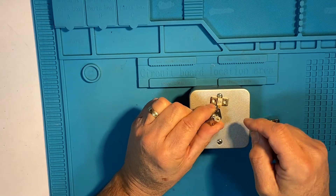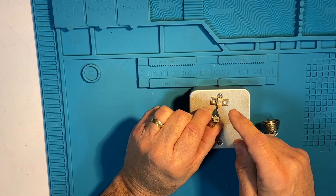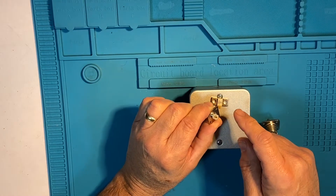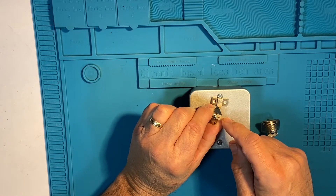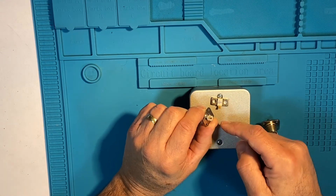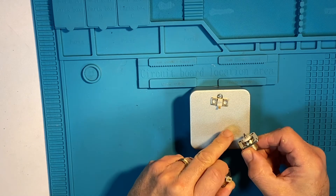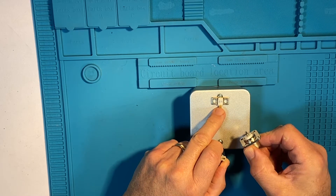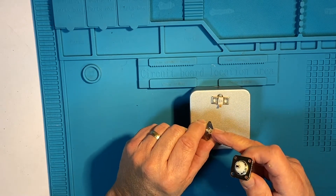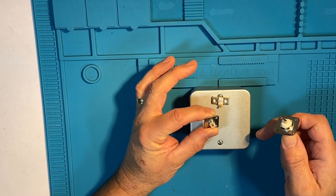I think the easiest way is to put a small resistor on there, leave one of the leads long to try first. This is what I've seen online anyway - there's a couple of ways of doing this: either a resistor on the end, or a small coil round the centre of the coax going through to that resistor, then coming back up and attaching to this, or through a variable resistor to adjust the gain.